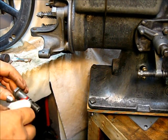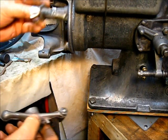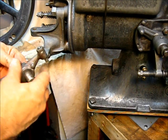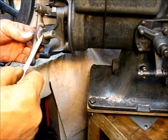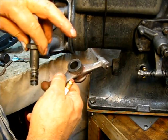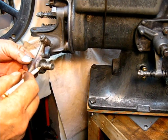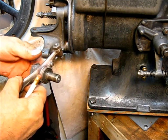Just a little pre-oiling — the way this thing oils, it's got a hole down in the center there and it comes out right on the side, and that goes right down in there. Don't put any grease on this. Now these right here — the shoulder on either the bolt head on this side or the bottom — these two positions are mismatched, and that's where you get your play, as well as from the roundness.